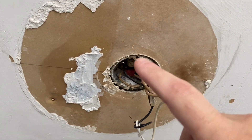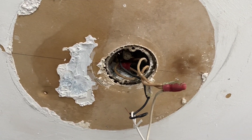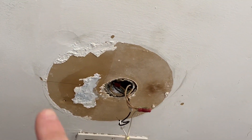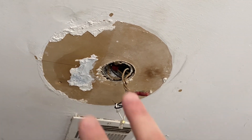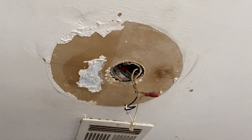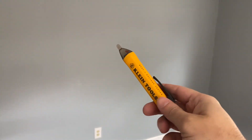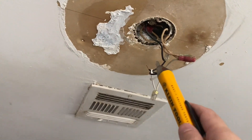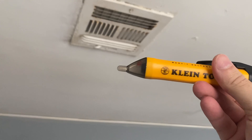You won't need these little bolts — if they don't match or the thing is too small or too big, it doesn't really matter. The light is going to cover around this area anyway. I'm checking to make sure the power is off by using an electrical tester — I'll link one in the description below. You're going to check the wires now after turning the switch on.